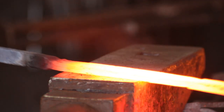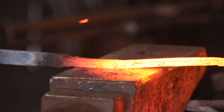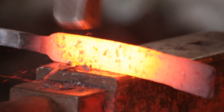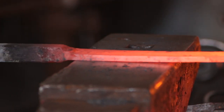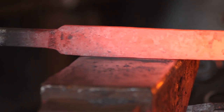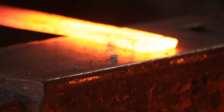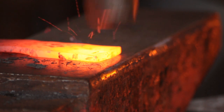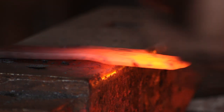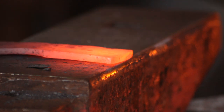With all that welded together, I will bring the body of the auger down to the correct thickness and the correct width, which is one and a quarter inch as mentioned before, and I'm looking for a thickness of around three sixteenths of an inch — all done by hand. Finally I will dress the thickness of the business end of the auger last, because I need the reference of the rest of the auger with regard to thickness. At that stage I will also start upsetting the end of the auger and spreading it out into a V-shape — you'll see why in a minute.